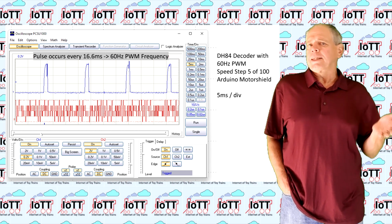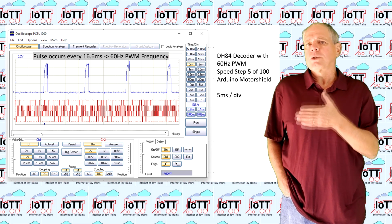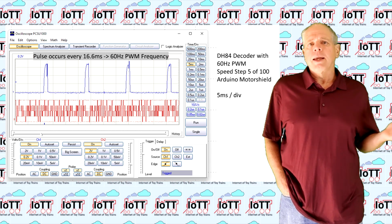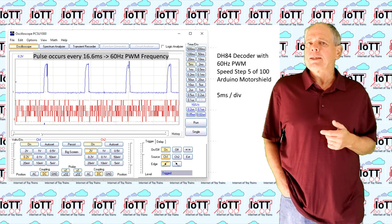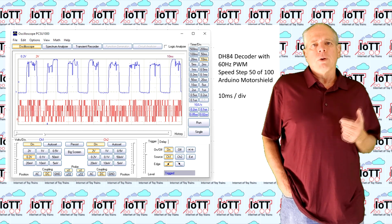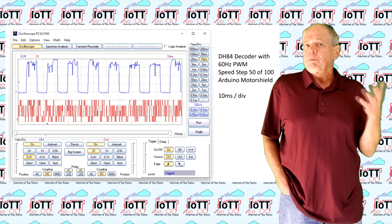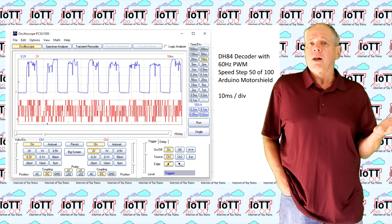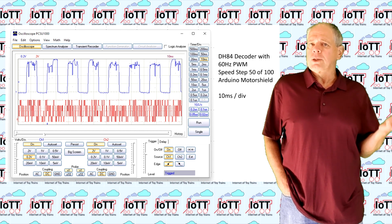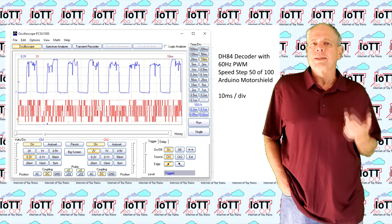But if you look at the individual spikes, they might well be around 1500 to 2000 milliamps, but only for a short moment. Now, if we increase the speed, the pulses get longer, as seen here, and while the overall current consumption of the power supply is also going up, the peak values of the individual pulses tend to become lower. And at full speed, the motor is constantly on, and the peak current and the supply current are basically identical.